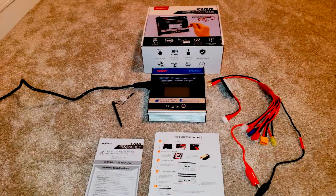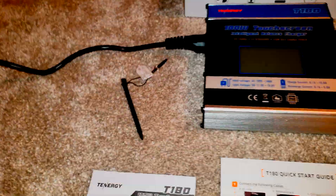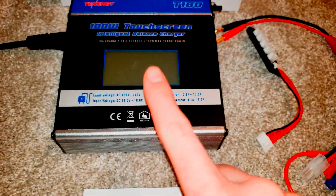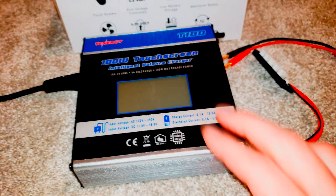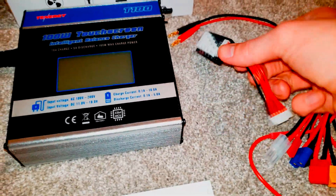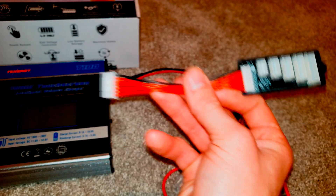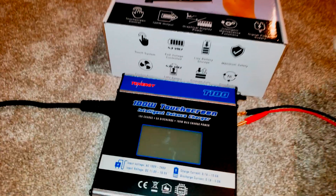So this is exactly what you get when you open the package. Pretty inclusive — you get an instruction manual, a quick start guide, and a stylus, which has a spot on the side of the charger where you can store it. You can also use your finger on the touchscreen, but it's not capacitive — it's a dual-layer resistive screen, so you have to press to feel the top layer move. For $70, you're paying for capabilities, not the touchscreen quality. It also comes with a balancer, so if you use lipo cells, you can balance up to 6S using the separate connector on the side.